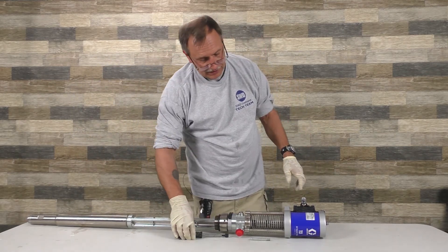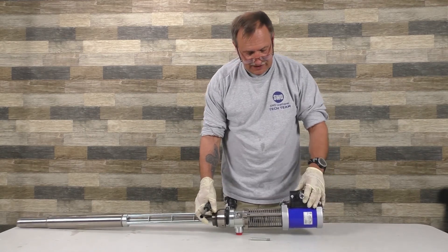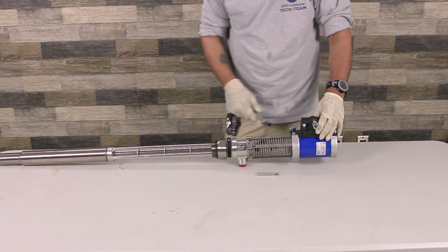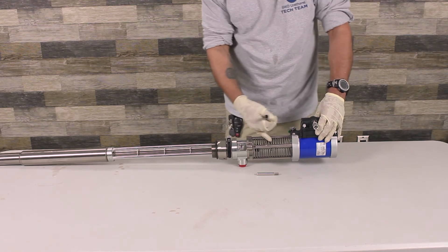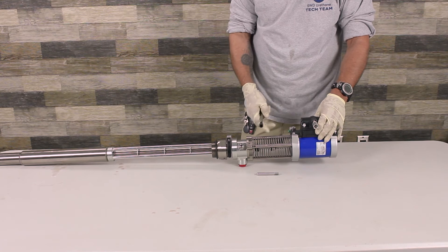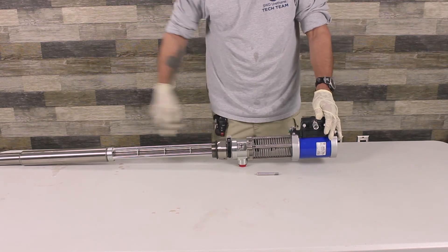Leaking air out of this — the only place I've seen air leak out is right here. If you have to separate the actual pump shaft from the air motor shaft, there's a pin in here that's held in place by a locking ring. Just pop it off and push it — it'll disconnect this so this assembly can be worked on separately from this.